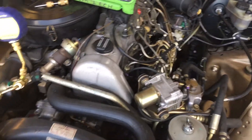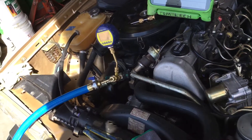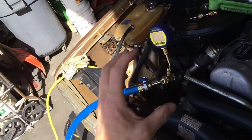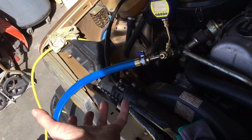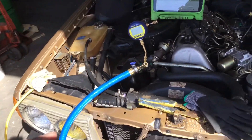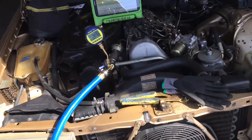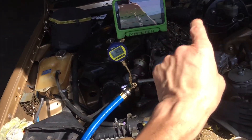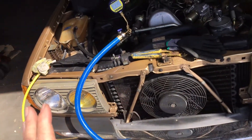The mechanic is fixing all the leaks. I know it had zero PSI — it was sitting for years with no refrigerant in the system whatsoever. So right off the bat I know all the rubber hoses have basically become like sponges and bleed refrigerant as they get older. This is normal — every car leaks refrigerant from day one off the factory floor. That was intentional because you can't put stainless steel lines, silver-brazed, no seals, no rubber gaskets on a car — things have to flex, especially from the engine to the firewall.